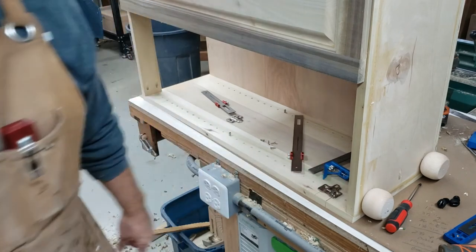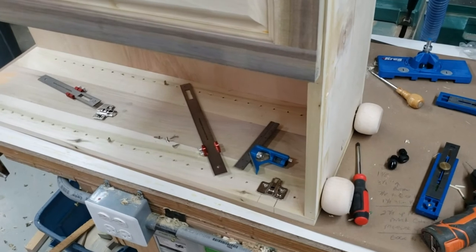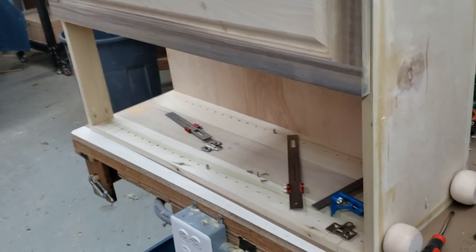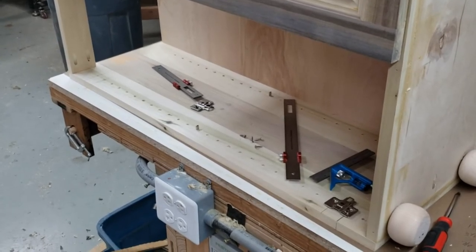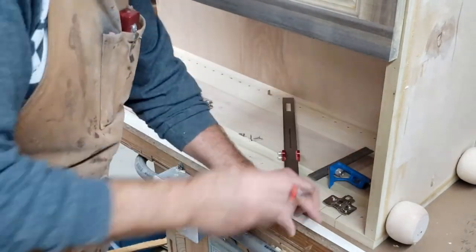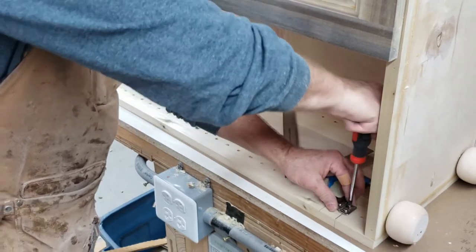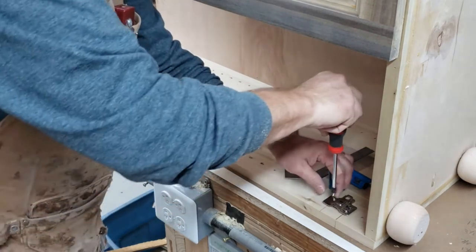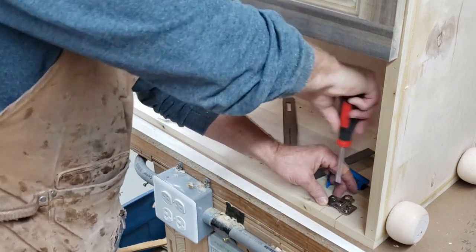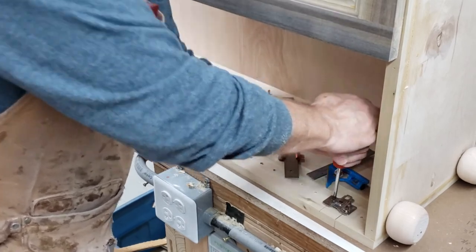The hinge pieces that go inside the cabinet have the main screws that hold them to the wood, plus two adjustment screws: one that moves the door in and out of the frame, and another that moves it up and down. I already have one door on, so this is the second door for this cabinet. I'm not too worried about getting these cabinet-side screws perfectly tight at this point. These small screws can be a little tough to hold with older fingers, but using the hand screwdriver ensures I don't strip them out.